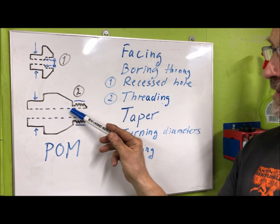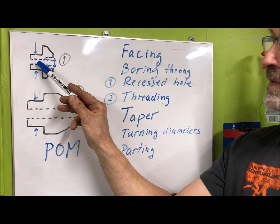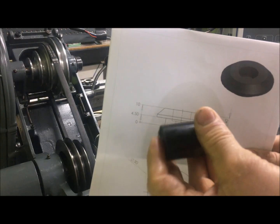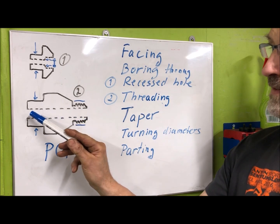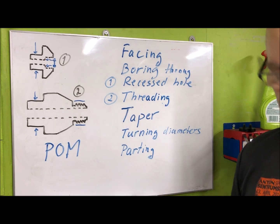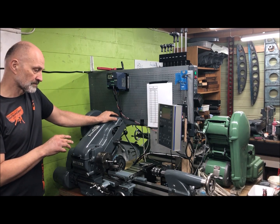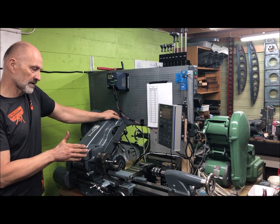I settled on using a mandrel on this one because it was such a long piece - a bigger piece. This one just chucked up. I thought I'd be chucking up a long piece and then parting in three. But I decided to take it in three steps - three different small knobs really. So just starting off with some pieces of POM, but this one at least I pressed on an arbor and then turned between centers, having the arbor in the chuck and then this one just with a center drilled hole.